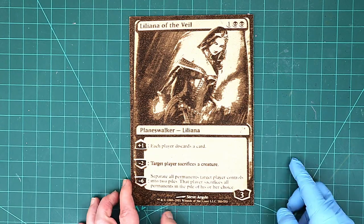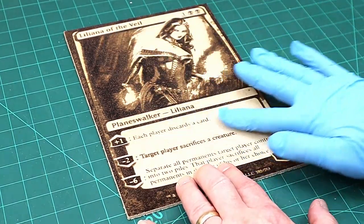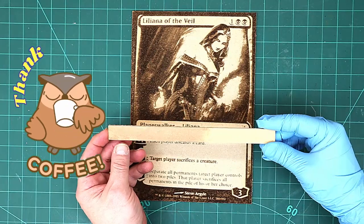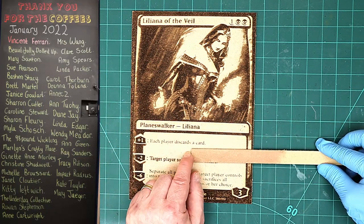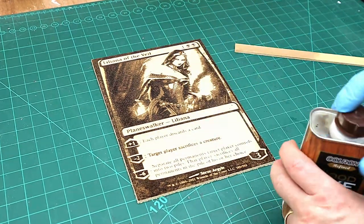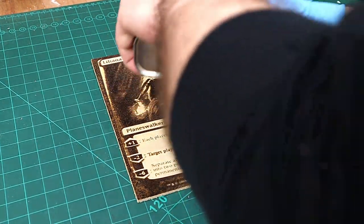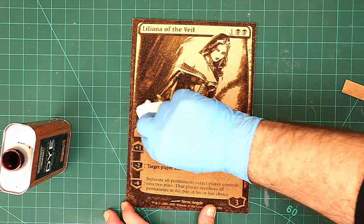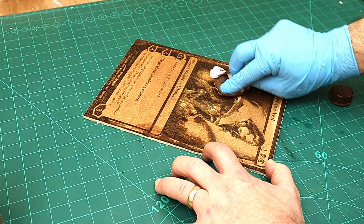Then I just leave that running — as long as you don't turn off your computer, you're all good. This is all engraved out and I'm really pleased with how it's come out. Just a couple of stages next — one is to stain it to get rid of this MDF colour. I've done a little swatch: that's antique pine and that's Indian rosewood. The Indian rosewood looks really nice in comparison to the antique pine, so I'm going to use that wood dye and rub it all over with a piece of cotton cloth. As that dries, it will lighten up a little bit, but it really does make it pop.